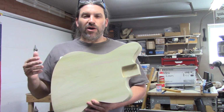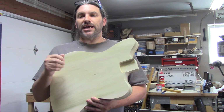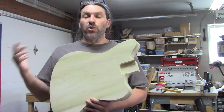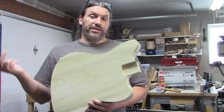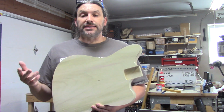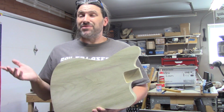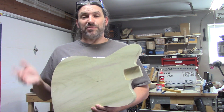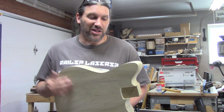Now we started this video off talking about speeds and feeds. The important thing is to make sure that you match your speeds and feeds to your tools, whether it's a hand plunge router or maybe not even a plunge router, a CNC machine or your pin router or shaper or even a hand tool. Something like sandpaper still has speeds and feeds. It's just much more forgiving than a high-speed cutting tool.